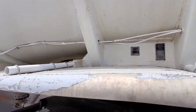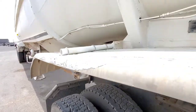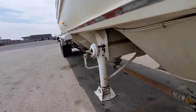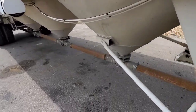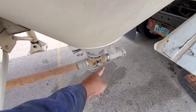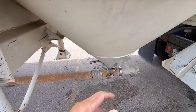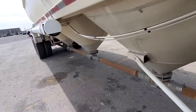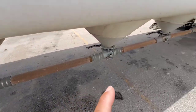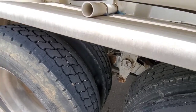It's like 1,600 cubic feet — normal capacity 1,500 cubic feet. I already greased this, then greased my entire trailer. I even got another video that I gotta put together checking these right here. This one I'm probably gonna end up replacing the seal on that because it needs to be replaced. That valve works fine, it closes fine, so the air is coming from somewhere else. I already checked my hoses — my hoses are good, checked all four of those. Checked my tires, greased everything, sprayed anti-seize on some of the other spots up in there.